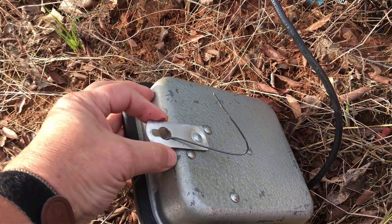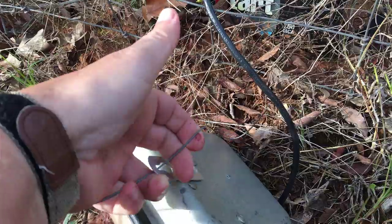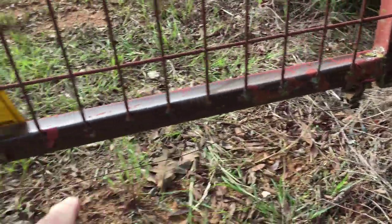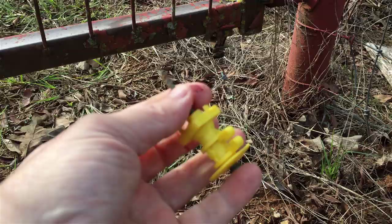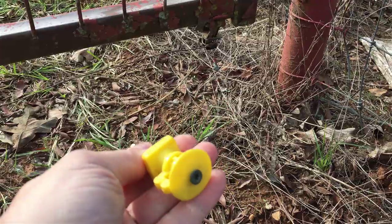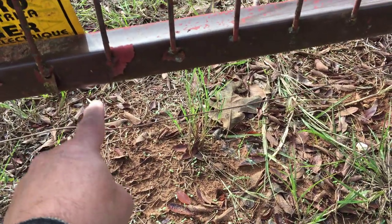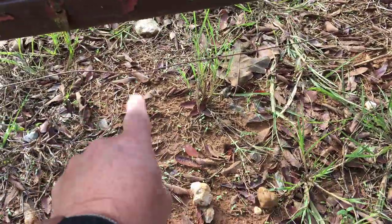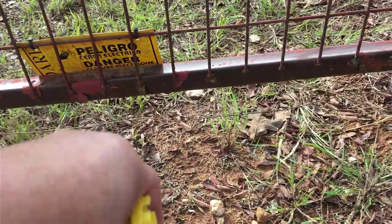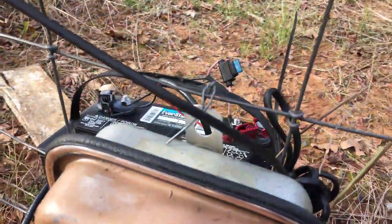The charger has a little tab on the back; I'm just going to hang it from this fence with a piece of wire — cut it off and hang it up like that. On the bottom of this fence in about four places I've screwed a little insulator up into the fence to hold the wire about two to three inches off the bottom of the fence and about six inches off the ground. So if an animal tries to scoot under there, there's just no way around it — they're gonna get bit.